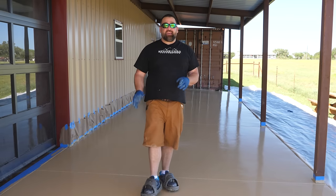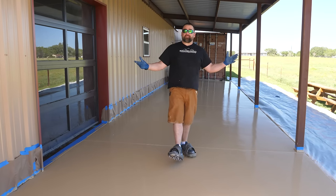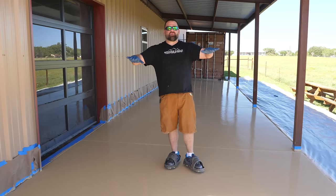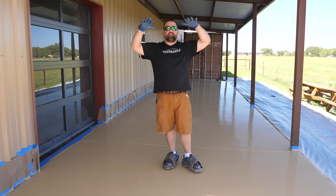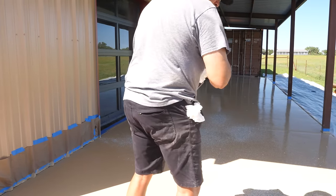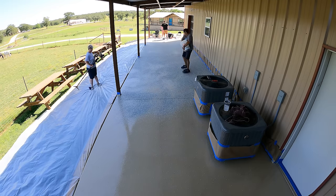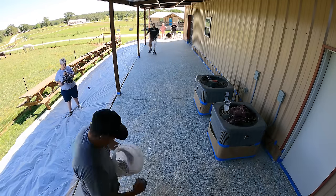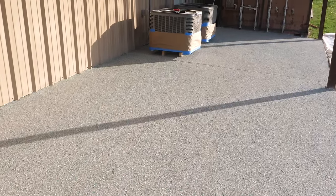It's time to apply the flake. We've got our custom ranch blend going on the floor — we're just going to throw out clumps and let the air and gravity disperse the flakes to a nice even coating. We're looking for completely dry flake coverage. If you flake the floor, come back and check it in 10 to 20 minutes — if you start seeing epoxy again, the flakes have settled, so just broadcast a little more flake. We have five different flake color options available, but if you want a special blend like today, check the link in the description. We're doing full flake coverage so apply it heavy, let it set up overnight, come back tomorrow and scrape off all the extra flakes, bag them up and save them for the next job.